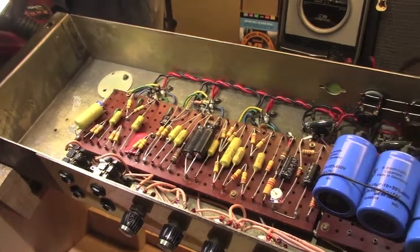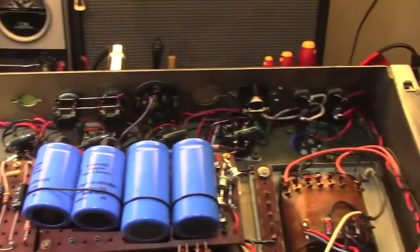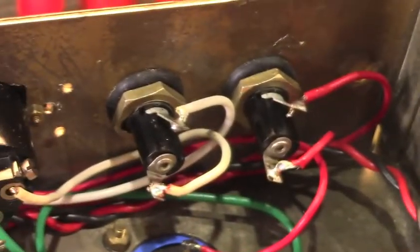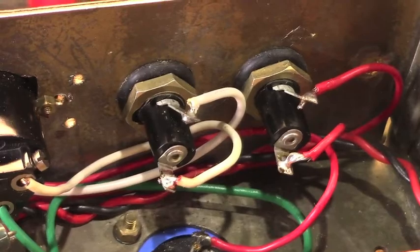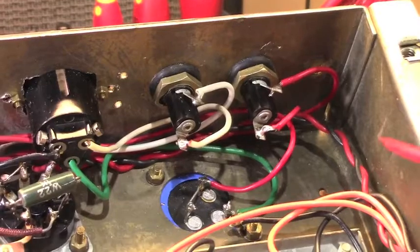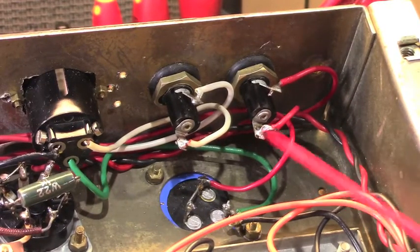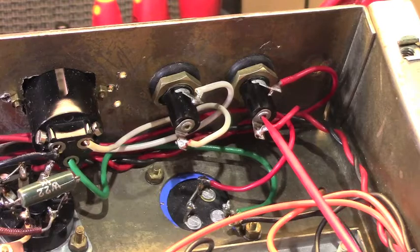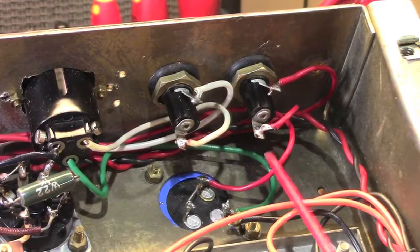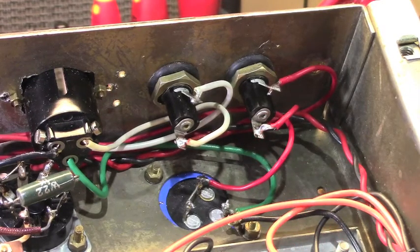One of which is something you hardly ever see. One of the fuse holders was actually at fault, and as you can see, I've replaced both of the fuse holders with appropriate holders that should outlive the rest of us. But one of them, the HT fuse holder, has a little contact inside, and this fuse was an incorrect value and was allowed to heat up so hard that it disconnected the little contact from inside the fuse holder. I've never seen anything like it in my career, and I say that almost every day anymore, it seems like.